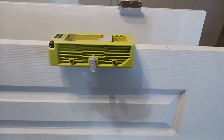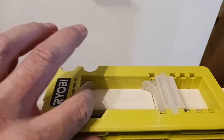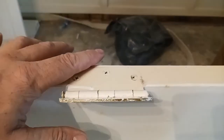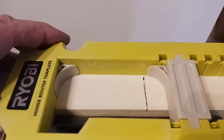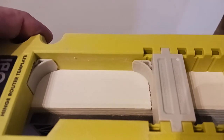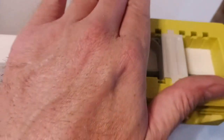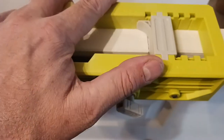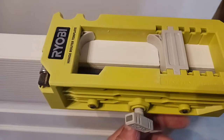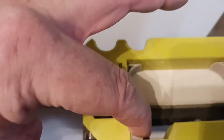First, I've got my measurements here. You want to make sure the round part on your jig matches the old door — you can see the round part here, you want to make sure it's the same. I put the jig right on that edge, about halfway on the mark, and when I tighten this down, do it nice and easy. Make sure it's flush and flat. If you bump it, make sure you get it right back on.